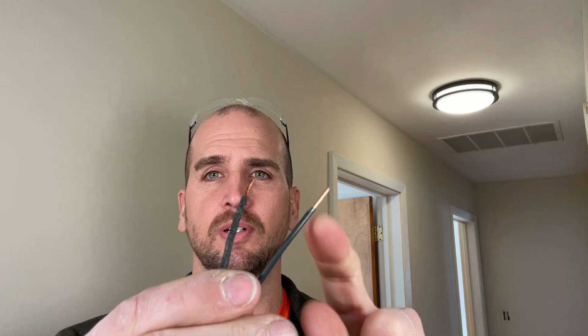Some people are intimidated by electrical work, and one part of that is just not being comfortable with wire nuts. But there are non-twist solutions, especially when you're dealing with solid core wire and then the braided strands that come through on light fixtures such as this. You can look up options such as what's called a Wago 221 lever nut. 221 is just the model number from Wago.